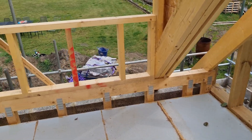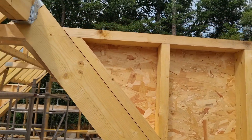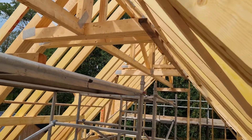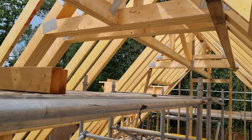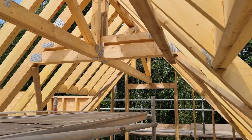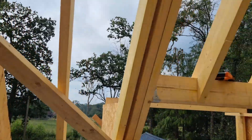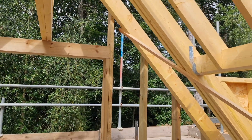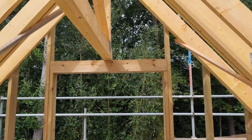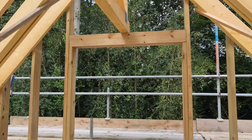Here's a typical dormer setup. We've got girder beams which sit on top of our wall plates — another integral part of the structural design. We land our dormer wall on top of that, then land a triple-up either side for the cheeks. I haven't pitched these yet because I'm going to put PIR all the way over the top and build it all off lay boards — otherwise you've got all those mitre intersections of PIR which makes it particularly difficult. The ceiling level is right here — we fix angled timbers along the backs of the rafters and then hang a smaller timber section from the truss out to those rafters.